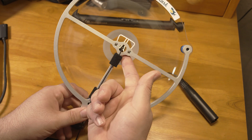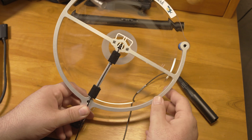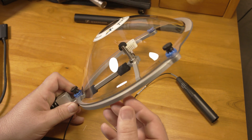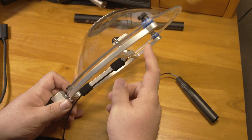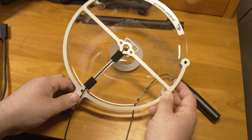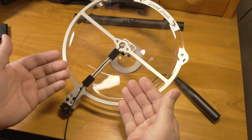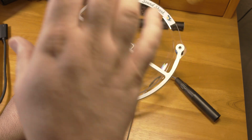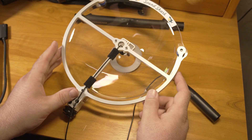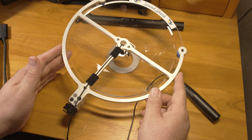In this case, a lavalier microphone is positioned at that focal point, so this type of microphone can, in a way, amplify distant sound making it louder at the microphone capsule. Because of the specific shape and the precise way that it reflects the sound, it will only focus sounds coming from a very specific direction into the microphone. This makes for a very directional and sound-amplifying microphone.